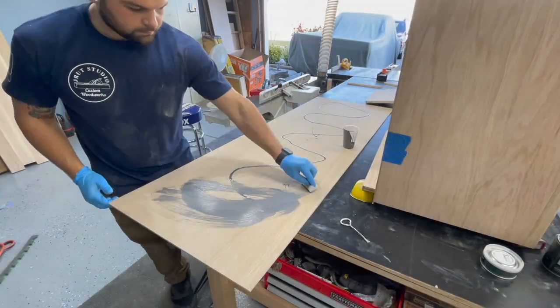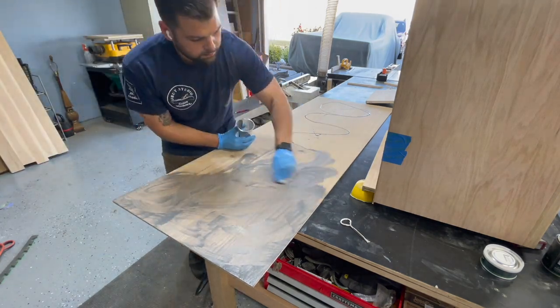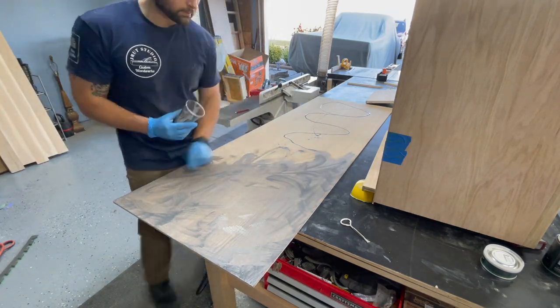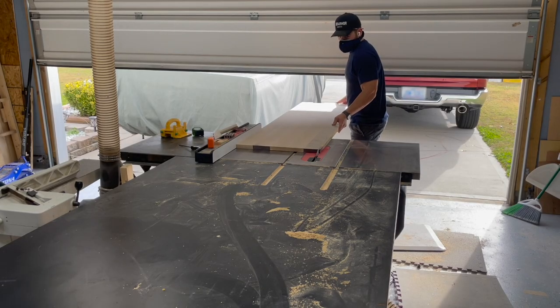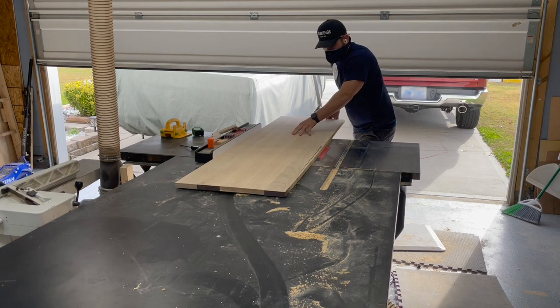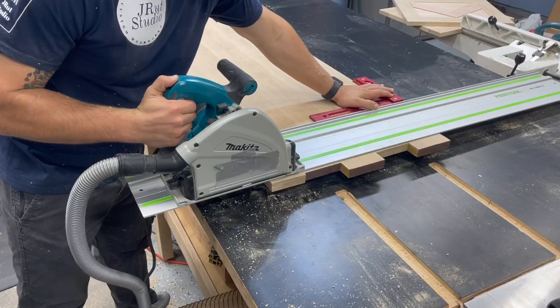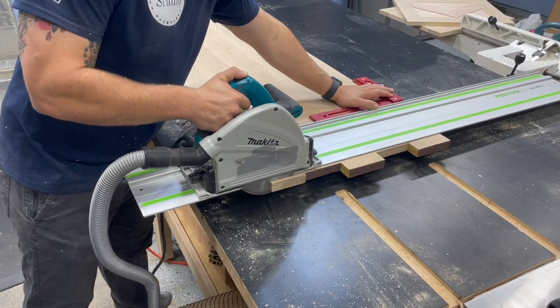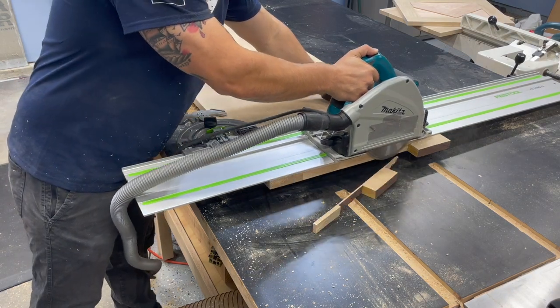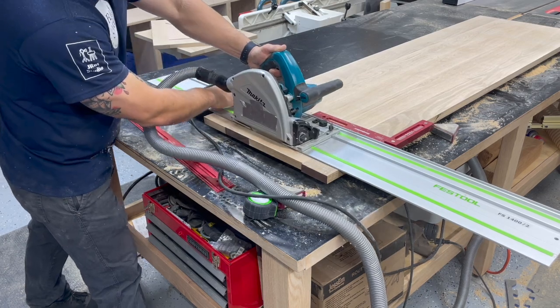To get some pieces out of the way, I started putting some finish on things so they could set off to the side and dry. The client had chosen Rubio Monocoat Havana — this is going to give it more of a gray, more of an industrial rustic feel, especially with the black hardware. The last thing we needed to do was cut the top down to size — I had it off to the side for a while to make sure it was the right width and length. Once I ripped it to width, I busted out the track saw and squared up one edge, then took my measurements and marked out for my final length.